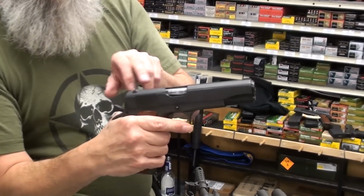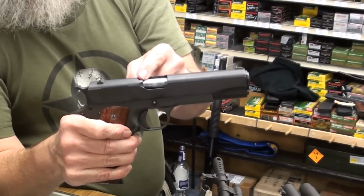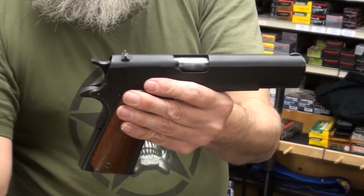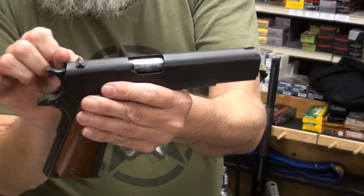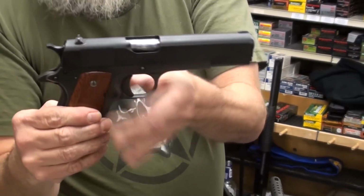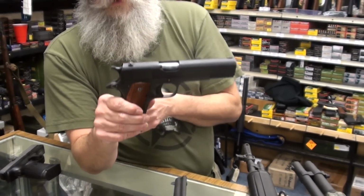This gun has an inertia firing pin, so when the hammer is all the way down, the firing pin does not protrude. It works like a Newton's cradle. When the hammer hits the firing pin, it's shot forward by inertia. That pops the cap, and then the firing pin is retracted for the next round. Right. It has an automatic firing pin return spring. I mean, it takes it right back. That is correct, but it is safe to carry this with a hammer all the way down.